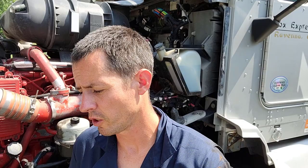Ryan here, starting part two of this series of doing this transmission job in my T660 Kenworth 10-speed manual. We're pulling out here. So first video, we got it all prepped, pulled the drive shafts out, air lines, grease lines, coolant lines, the transmission cooler and all that type of stuff, and just got it all prepped basically down to the bell housing bolts is the only thing we got left.